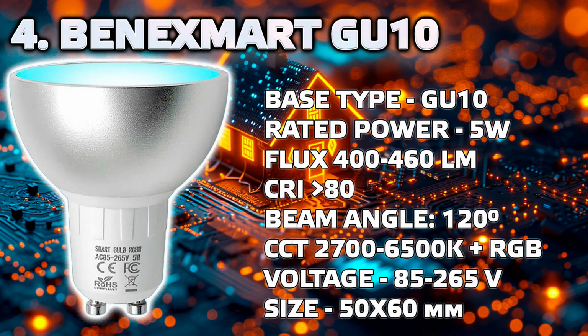The fourth bulb is the largest in the test. However, the difference is just a few millimeters. The light flux is 400 to 460 lumens, with a color rendering index of at least 80 and a 120-degree angle. The range is standard from 2700 to 6500 Kelvin.